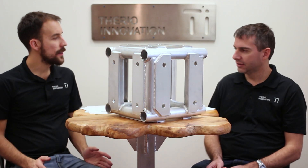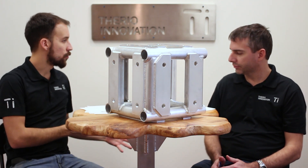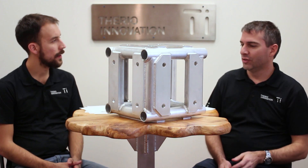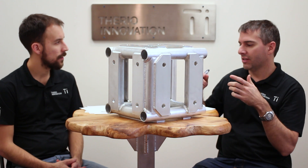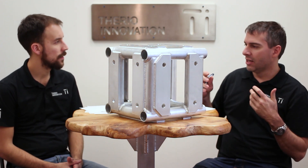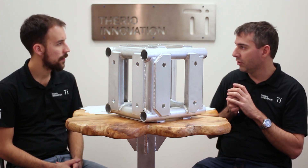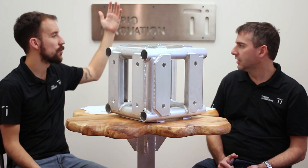My first question is: why don't cubes have a capacity chart like a standard truss? The answer is that there are too many scenarios for a cube. A cube has six faces, so you can attach truss on six different sides. There would be too many different spans to attach to a cube, making it very difficult to have an understandable capacity chart that would cover all the scenarios — it would be a document of like 600 pages.